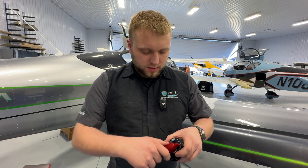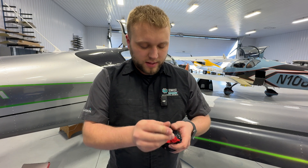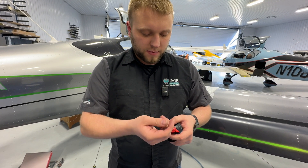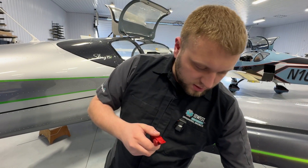This handle comes off from that little screw in the middle there — two and a half millimeter hex key on there. You unscrew that and the handle will start to come up at the same time. That's as easy as that.